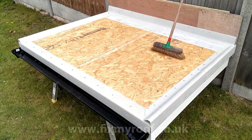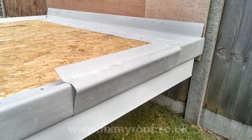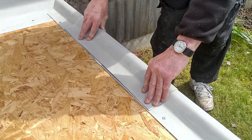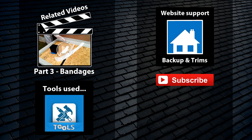With the trims now complete for our project it's time to thoroughly sweep the roof decking of any debris or offcuts. There is just one quick point to mention before ending the video: if the roof is to be accessed regularly, for instance by a window cleaner, it may be a good idea to build in a ladder access point. Cut a section of matching trim about one meter in length and fix it in the same manner as joining a trim, with a line of PU adhesive at both overlapping edges. This is only a demo roof at knee height so it doesn't need a ladder access point, so I'll skip it on this occasion. That concludes this video on fitting roof trims. For a full list of trims click on any of the links provided here or in the description bar, and I'll see you in the next video, part three, which covers cleaning, taping and laminating the bandages.